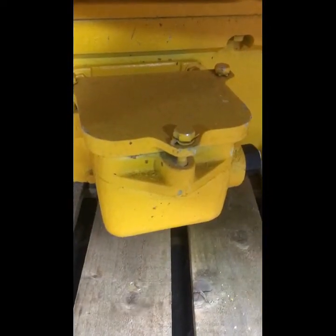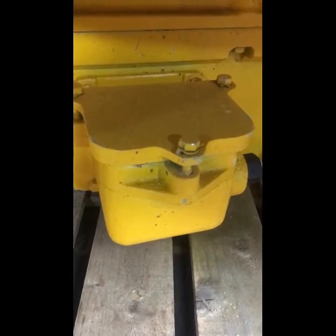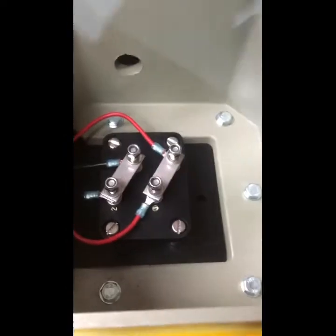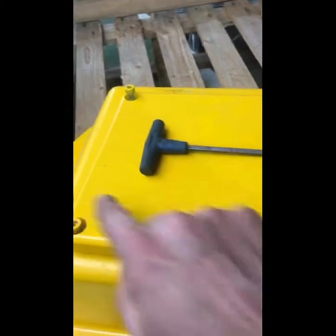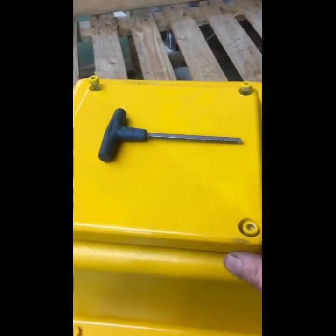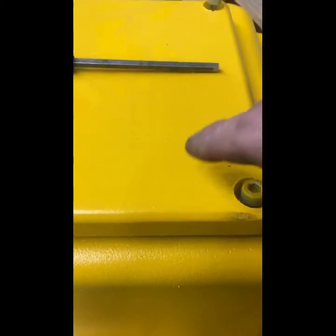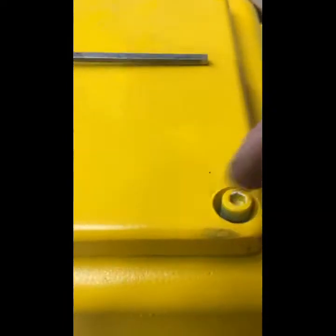There's the old style of AWS Electro — this is the mount on the side for putting your cabling into. As you can see, it has a giant belly underneath the actual magnet itself. This is the inside of a new pattern Electro AWS, and the cover comes off with these four Allen screws. It looks symmetrical, but I'll be honest — it isn't. Most people have put a mark on it to show where it exactly goes back. If you put it on the wrong way around, you'll find it's a bit of an awkward fit. There is a very slight difference in the sizing of the sides and longitudes.